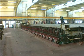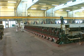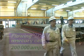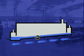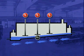This is one of the 106 cells in the flowing mercury cathode cell room. It produces a quarter of a tonne of chlorine per hour and needs a current of 200,000 amps. The cell has a sloping base down which flows a stream of mercury — this is the cathode of the cell. Three millimetres above the mercury are grids of titanium, the anodes.